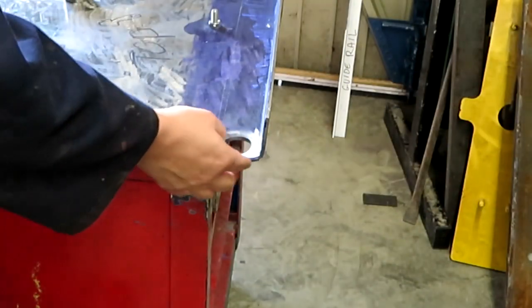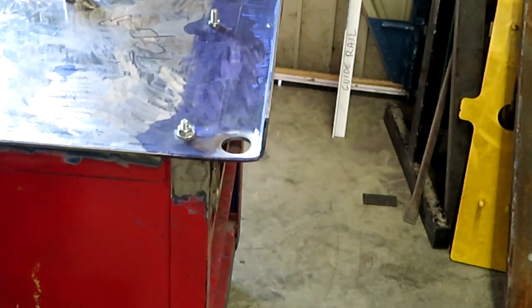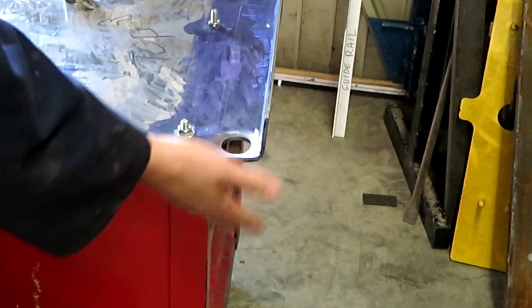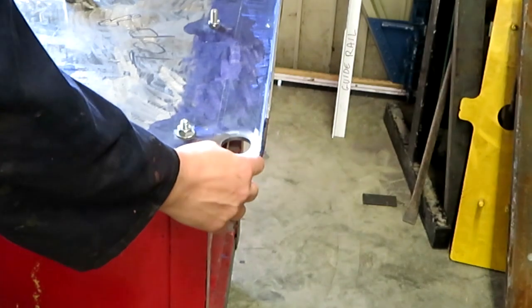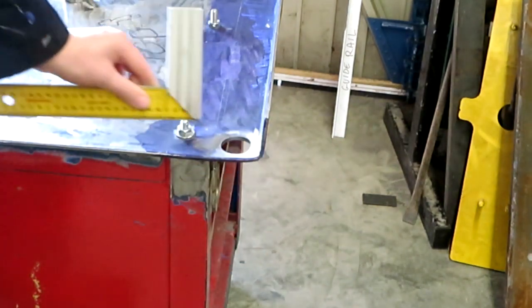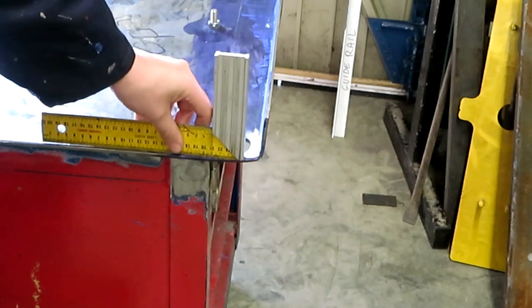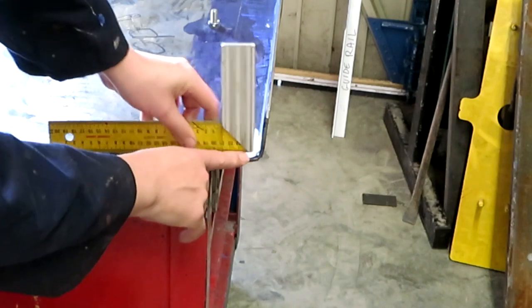As you can see, we've achieved pretty much a 90 degree bend here in our 6mm plate, and that really wasn't easy to do. But unfortunately, I was doing so much banging around, pushing and pulling, I have managed to bend the whole plate. I'm not really sure why it chose not to bend at the point at which I actually put the cut mark in, but you can see I've very slightly distorted the whole plate. It's actually bending up here.